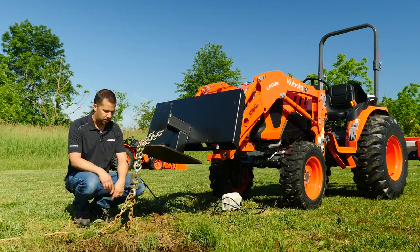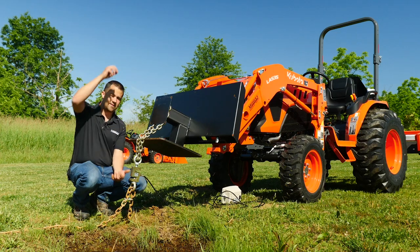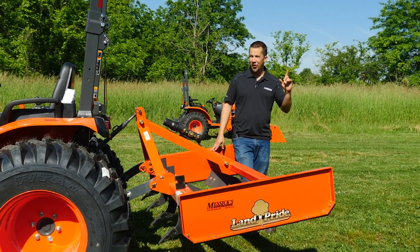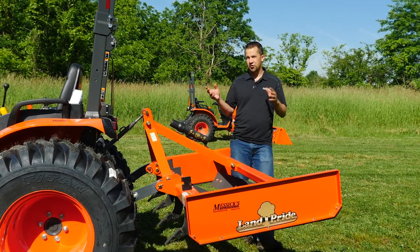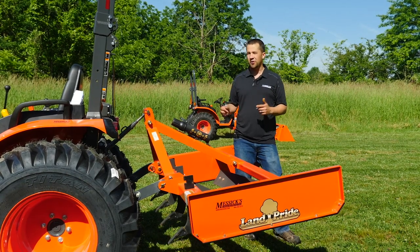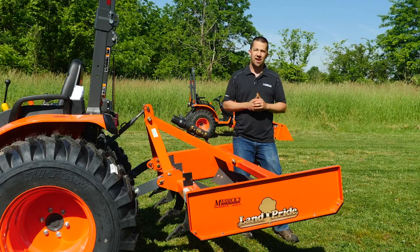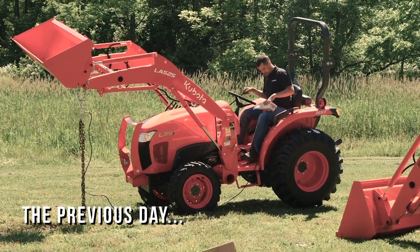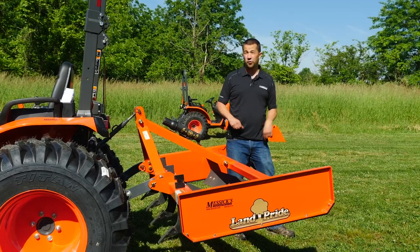This is a 10,000-pound load cell attached to a chain that's attached to a tire buried about 10 feet underground, so we're going to try to lift this thing up and see what kind of loads we get off of this loader at varying heights. This is actually day two of shooting this video. You'll notice on the back of the tractor we have a grading scraper attached — this is for ballast. Adding ballast to your tractor is not some sleazy dealer add-on; it's us making sure the machine is set up properly, both for safety and so you can get the most out of it capacity-wise. When we were lifting with no ballast, we were easily picking tires up in the air, not giving us real measurements out front. That's why this scraper is back here — to keep the rear end of the machine planted.